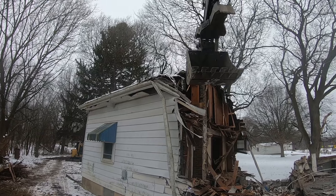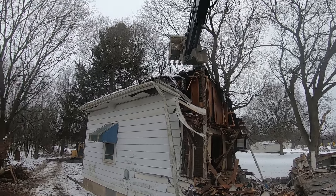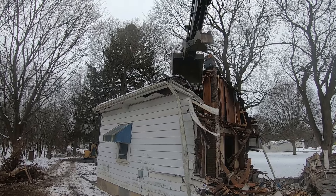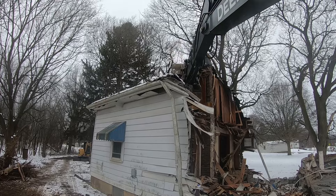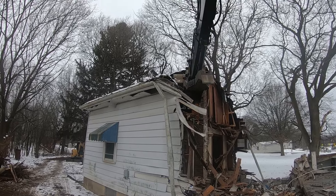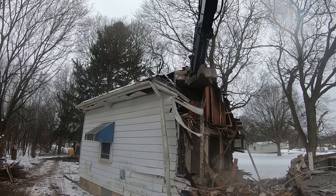I want to keep working this part of the house down on this side. I could just come in here and push on it really hard, but it'll come down easier if I destroy the roof above it first. The reason is simply that the roof and the wall make a corner, and again — the corners are the strongest. If we can get that out of the way, we can push the wall in pretty easily, and it'll be more likely to fall into the building rather than buckle and push outside. There are also interior walls and the second floor that I'm going to break out — those will make it easier to push this wall in.